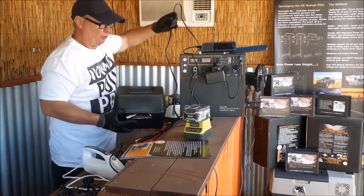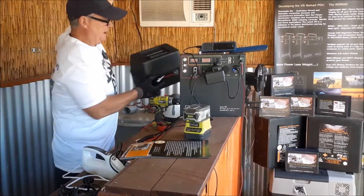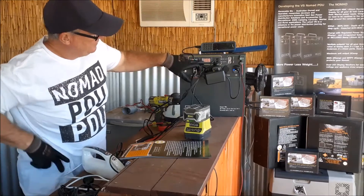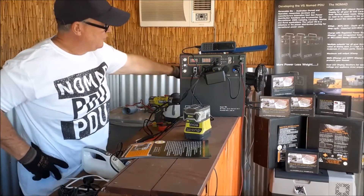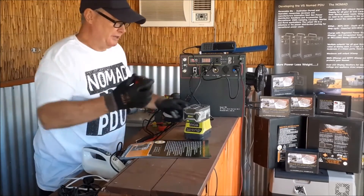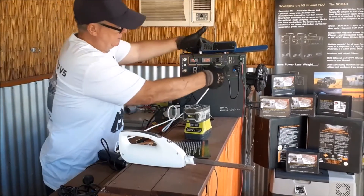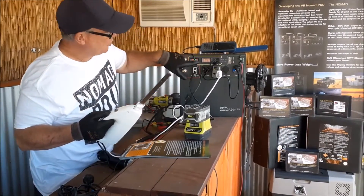You can also plug in a small camping oven. This camping oven draws — they say 10 amps but I know it draws a bit more. I've cut the end off mine and put an Anderson connector on it, but for the demo you can heat up your food. Now it's reading 14 to 15 to 15.9 amps with the oven running, so you've got about three or four amps left. We've got lights running as well. Let's pull the inverter out for now.